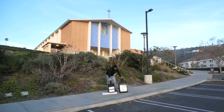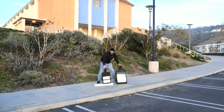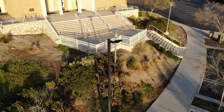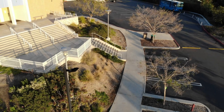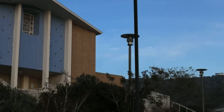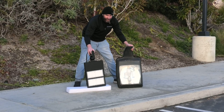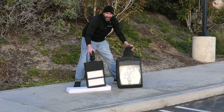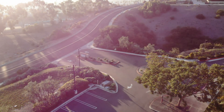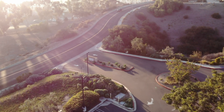We're showing you some of the lights we're replacing here at Our Lady of Fatima Church. These are the old lights that have been removed — 250 watt metal halides, enormous fixtures. The lights going up replacing these are 150 watt LEDs, which are a nice step up in power. We also brought a 300 watt Next Gen to show you size comparison — this is the 300 watt versus the old 250 watt metal halide. Big difference. The old 250 watt is still a huge compartment and huge fixture versus the 300 watt, which is twice as bright as the lights going up. A lot easier to handle with LEDs — a lot smaller fixtures with a lot more power.